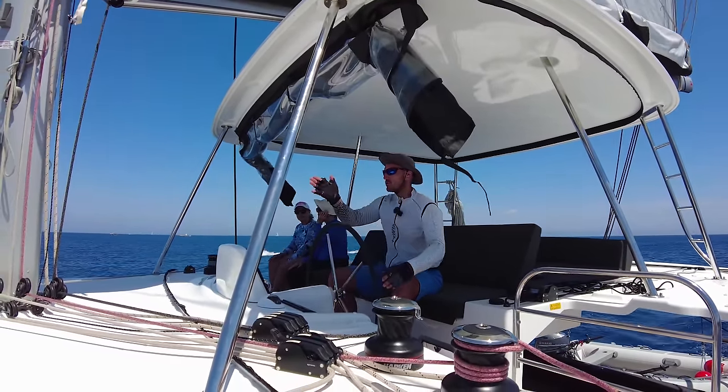So now the more the jib is in, the less it's going to bang. And then I tension the main sheet. The main sheet is the one holding the sail down. I tension it quite a lot, so we can take a look there. Tensioning the main sheet prevents the sail from being too flexible and doing that puff, like tsh. So it's way easier.